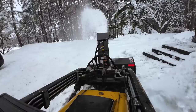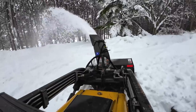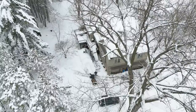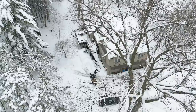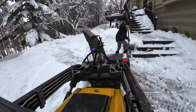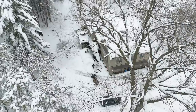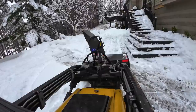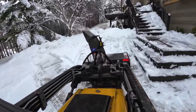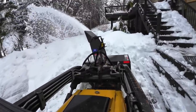And the other side is putting it off into the future, because the actual bathroom itself, like a toilet and a sink, is not particularly expensive or that big of an endeavor to take care of, but it's what goes in and goes out of those bathroom fixtures that gets a little more complicated. So out here, I would have to get back to our septic system or have a separate septic system installed for the barn. I don't know which one is more practical. Connecting about 400 feet back to the house with septic and water, or just connecting 400 feet back to the house for water and then putting in a separate septic. I don't know. It's for a future deal, future tearing up the yard kind of thing.